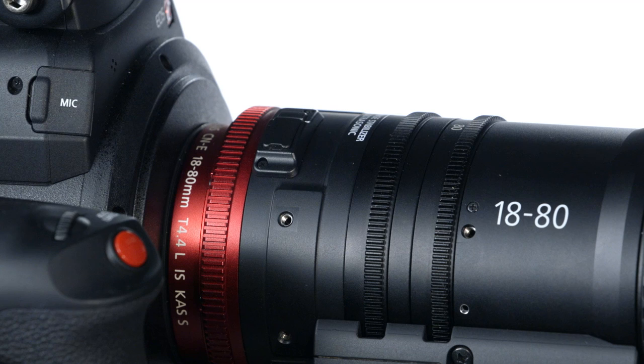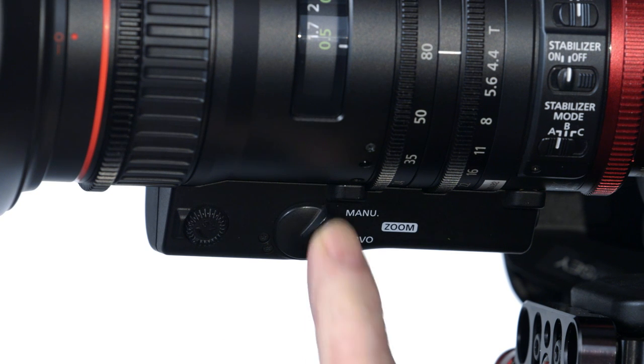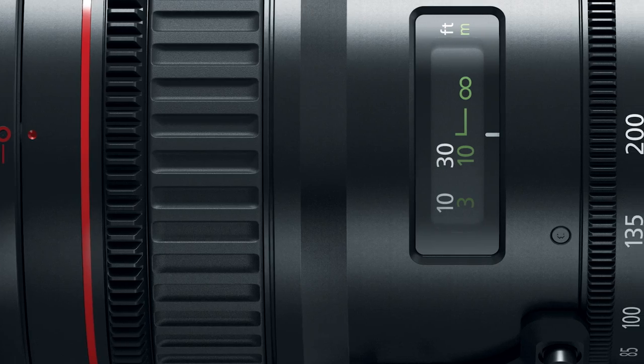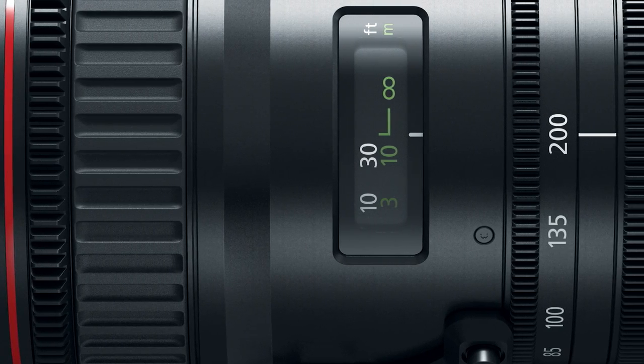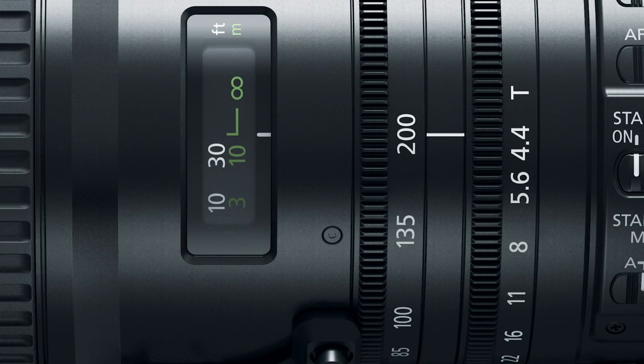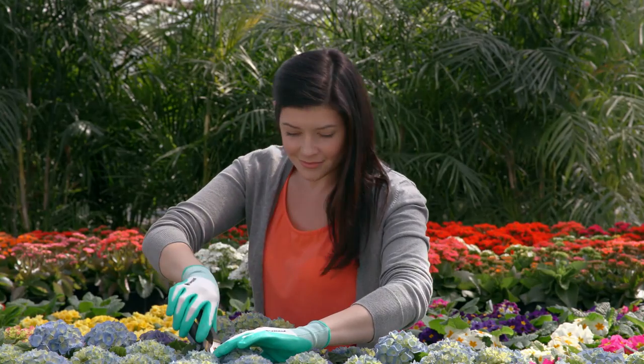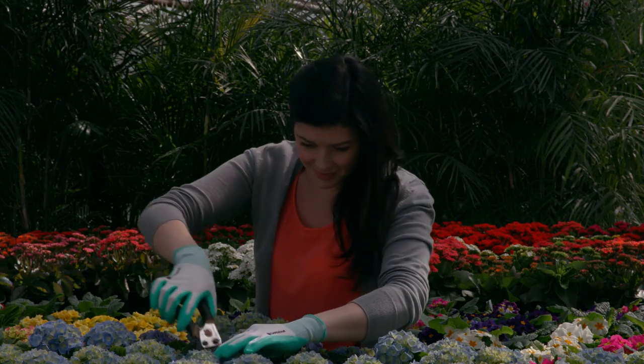Flange back adjustment is behind the red housing at the rear element. On the lens itself, you can choose between servo or manual operating controls, whichever you prefer. Unlike standard still lenses, it has a manual ring for focus, zoom, and iris, and you can easily shift between manual or servo on the fly. Like our cine lenses, the iris ring allows for the iris to be fully closed — a necessary feature for black balance adjustment.